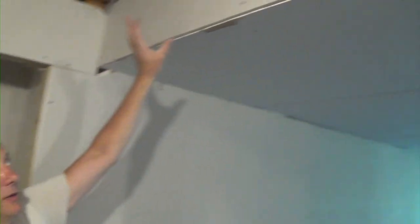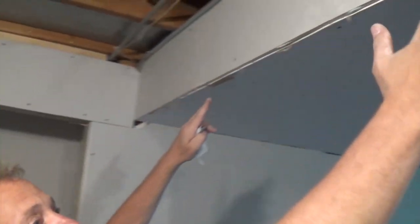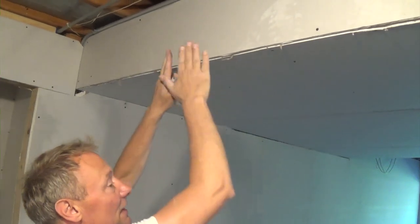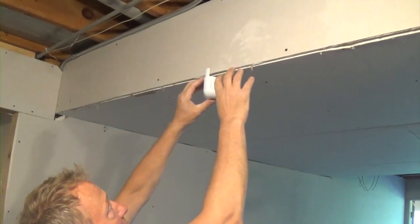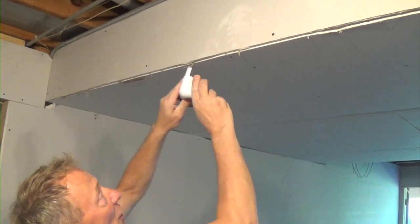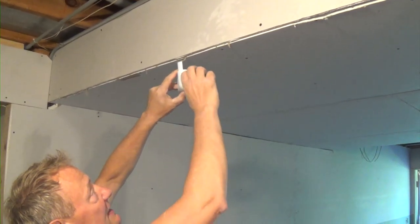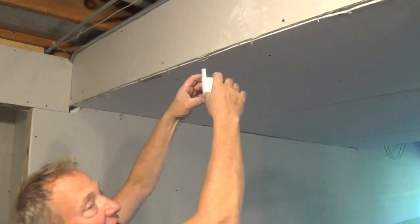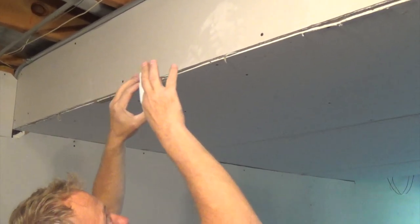On regular corner beads, yes — when this is bullnose, that makes a huge difference. But if the soffit's coming in and then splaying like this and then coming down, so this is a 120 bead up here going down — what I like to do is put this on and cut it to fit on that off angle. I'll split this open, make a little slice here, open this up, and splay this to make it fit on the corner. Then I just butt up all the bullnose to it. That's how I do it.